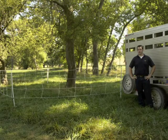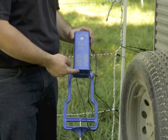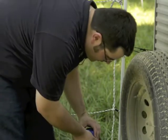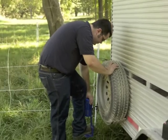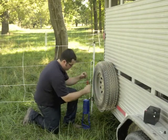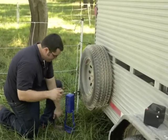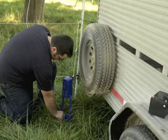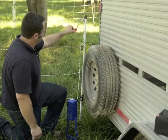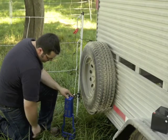We are now going to electrify the horse quick fence with the 12B energizer. There is an on/off switch at the bottom of the energizer as well as a fast speed or normal speed switch. Insert the energizer into the soil. Take the ground clip and connect it to the ground rod of the energizer. Connect the fence clip to your stainless steel clip on the netting and turn on your energizer.